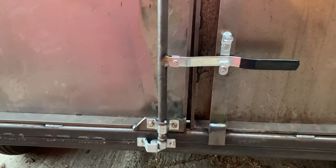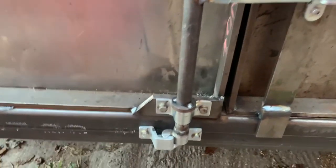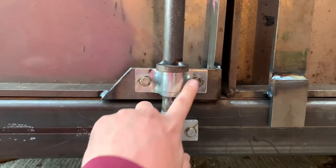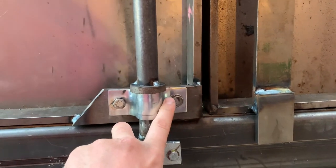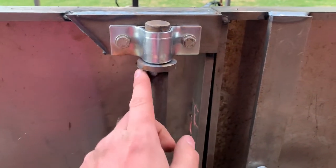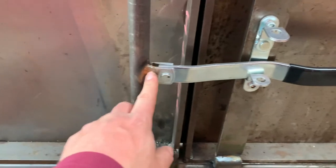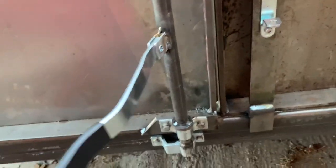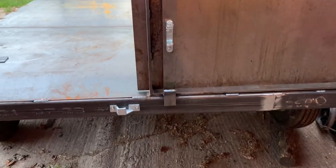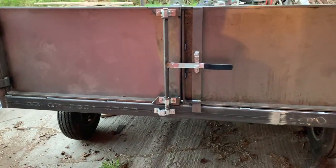I bought this cam actuated door lock. I put these on here first - drilled and tapped - and then did the same thing up top. I had these little pieces of pipe so I welded them on so the handle can't go anywhere, then set the handle where it needed to be. I extended the sheet metal on the back side a little bit farther and put a stop there that holds the latch. Turned out really good. Part of me thinks I should have not bought that and just figured out my own, but whatever.